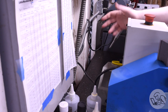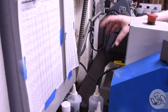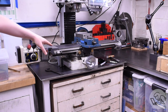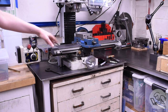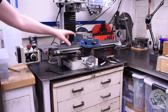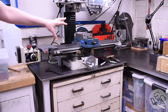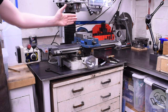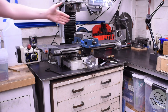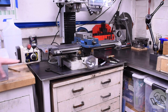This is why you often see big lathes sitting in the middle of the room in machine shops — access back here is often important. For the milling machine, the main concern is having room for the travel of the table. This is a little tricky for a benchtop machine because it consumes a lot of potential space but very little actual space. You can see how I've managed that problem by putting the mill in the corner so the table can extend over bench space that's not frequently used, but I still have access to that space when I need it. On the other end, it extends over an adjoining workbench — most of the time I can use that workbench space, but when I need the clearance to move the table, I have it.